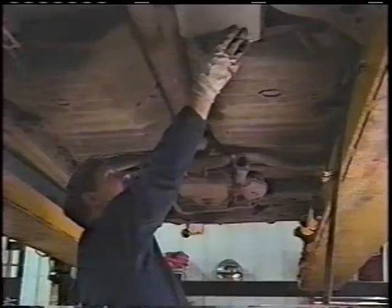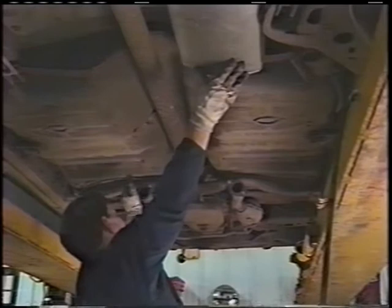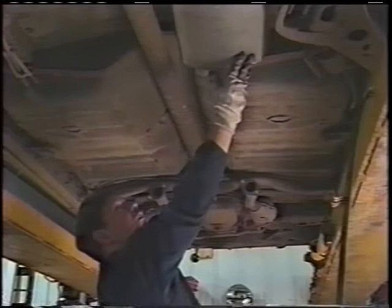The one thing you'll need to remember is that we're going to complete the whole right side from start to finish, and clamp it, support it, and finish it into its point. After the right side has been fully installed and completed, the second thing I'm going to do is build my crossover that comes in and hooks into the right-hand side. We're going to hook the left side into the right side. I'll show you how to make a hole in the pipe, how to mark it and cut it, and weld it into place. That'll be the very last thing we do, is hook that pipe in.